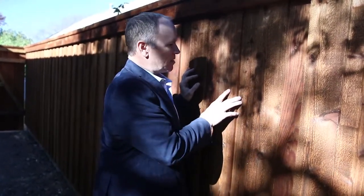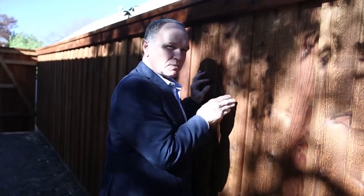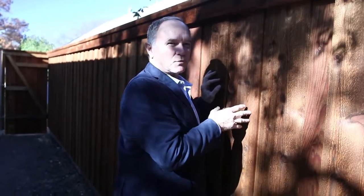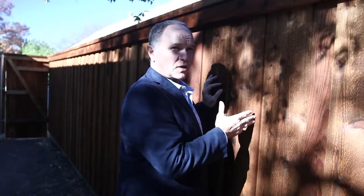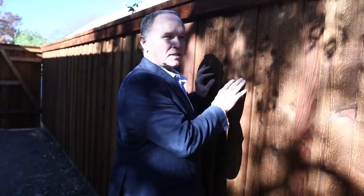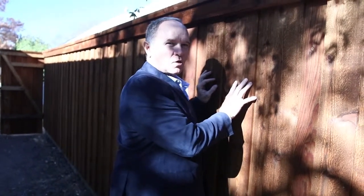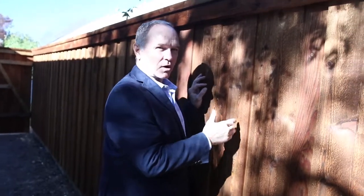But this product — putting a stain on it — is actually good for the wood. It actually moisturizes the wood and keeps it from splitting. Not 100%, but tremendously reducing the amount of splits. And what's great is you put another coat on it, the splits aren't going to hurt anything. It's not going to rot in those splits because it's not trapping the moisture. It'll eventually dry out some and get a few splits, but this is going to make it last virtually as long as the home will be here. That stain is a big part of preserving.